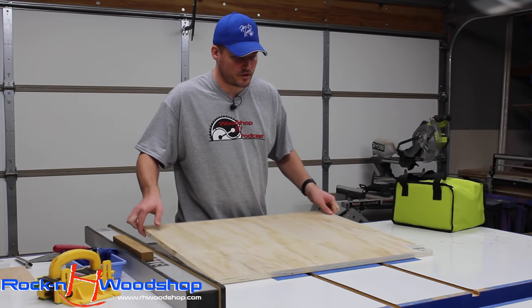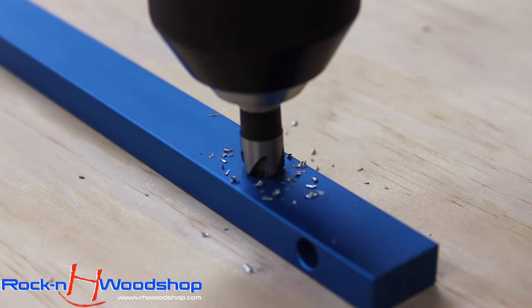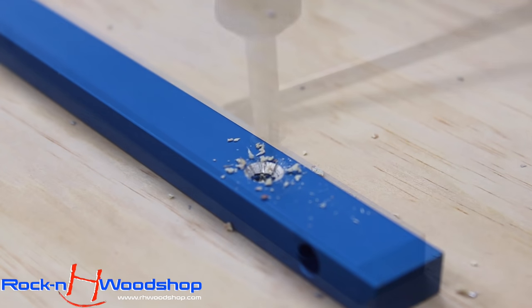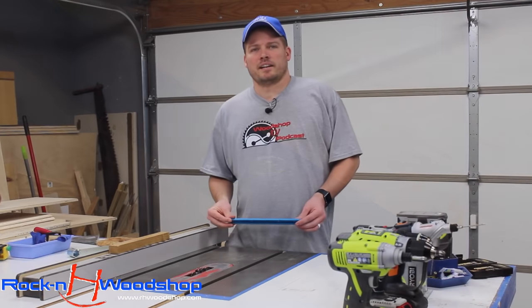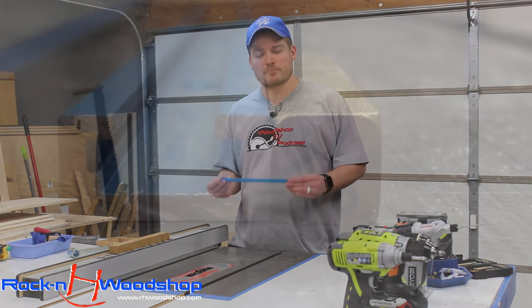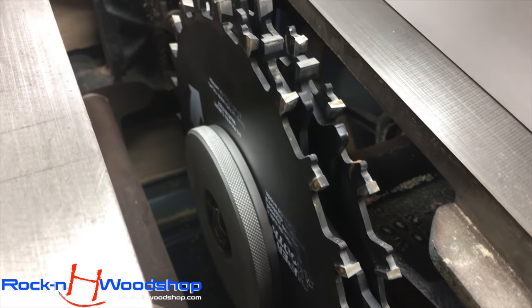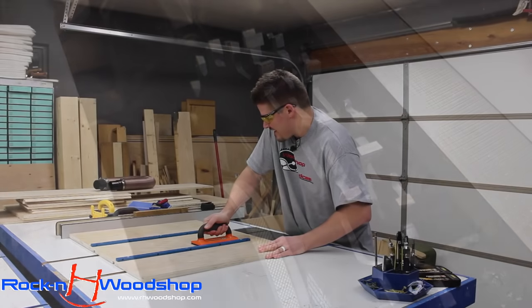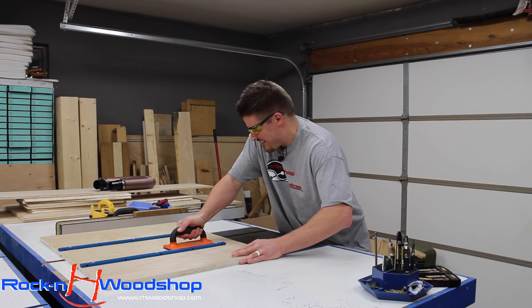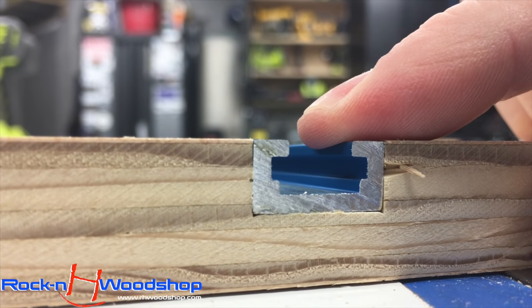Now that the glue is cured, we can take it out of the miter slots, then countersink the holes just a little bit deeper so the screws sit below the surface and won't drag inside the miter slot. I plan on inserting some t-track inside the sled down the width of it to make it more versatile, and also in the fence. I've changed my blade out to the dado stack, and after running a few test cuts I've got the depth and width set so the t-track sits just like a glove and is slightly lower than the surface of the sled so it doesn't catch.